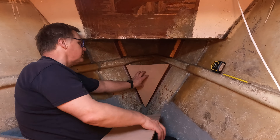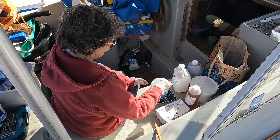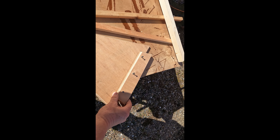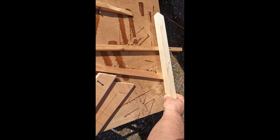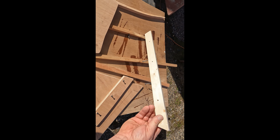We've at last managed to get the resin to go liquid - the fore cabin is up to 30 degrees now. The resin is liquid and we're just mixing up some to coat all the wood before we fit the bulkhead. Here are the bits of wood ready to be coated in epoxy. This is going to go there as the joint between the two bits of bulkhead, and that's going to go up against the deckhead for the bulkhead to fit against. We're going to coat them all and then these two will get glued into place.